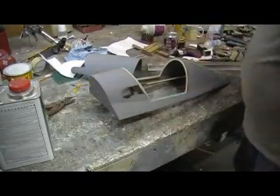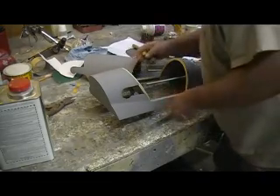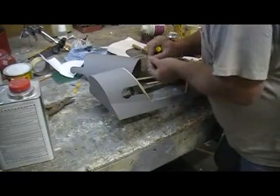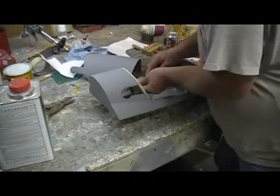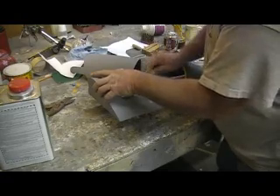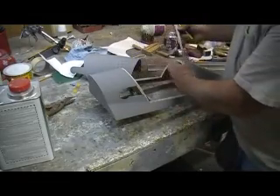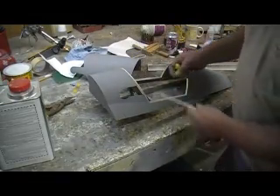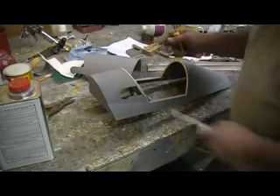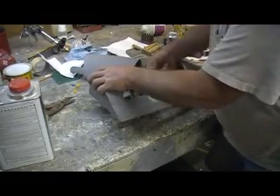See, if I was going to glue this up I would shim — put some shims back behind these screws. But we ain't going to do that now. Or what I could do is just build it all to where I can slide it forward just a little bit, still putting shims down here, but build it to where I'm sure I could slide that forward just a fraction. You just got to be aware you can't build it tight.